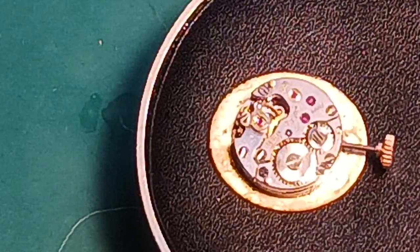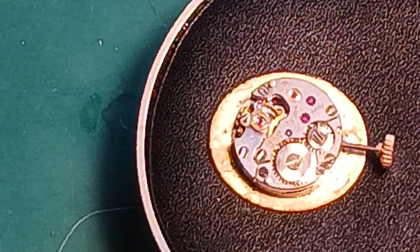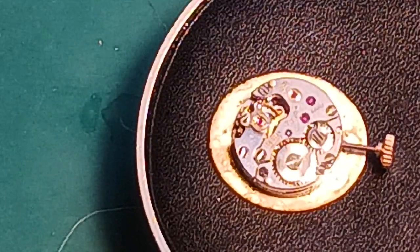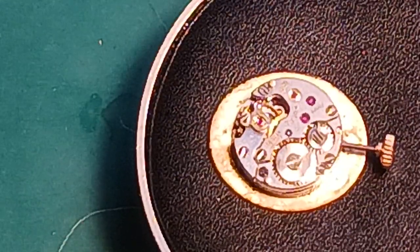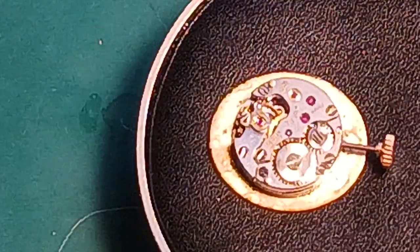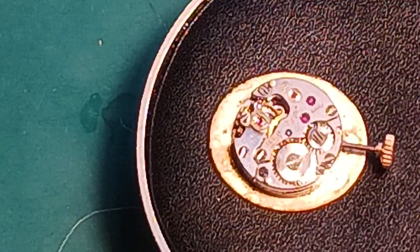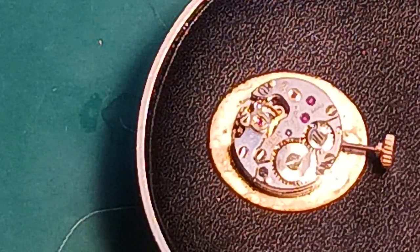In this particular case, I'm putting in a window. I'm sealing up some drafty areas in our house and pulling down the crown molding. Because between the ceilings and the walls in our house there's about a half inch or quarter inch gap, and heat was escaping those cracks. So in order to seal it better, keep more heat in our house and reduce our energy bill, I used the Great Stuff. And I will say Great Stuff helped a tremendous amount. I can notice a difference already, almost immediately.